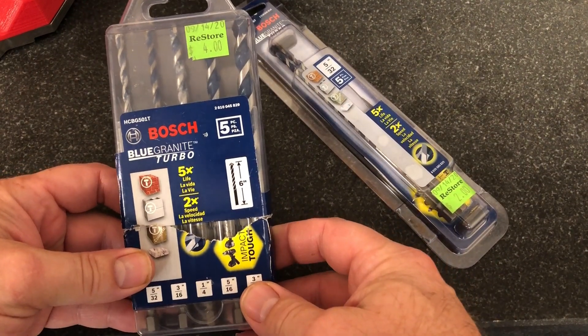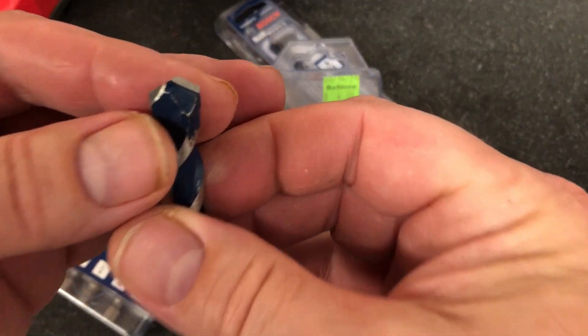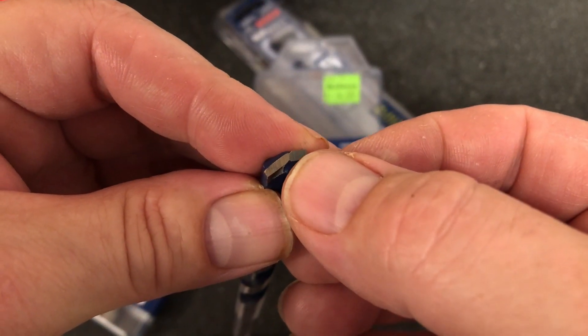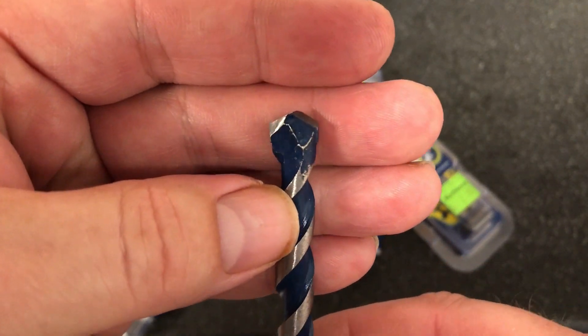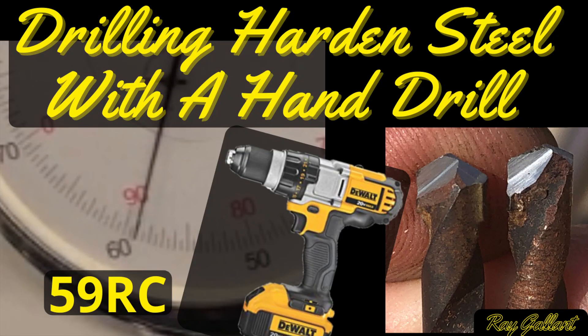I was going through the store the other day and I saw these Bosch turbo granite drills. I took a look at them and thought, wow, that's almost the exact same as what I'm doing here, except you need to thin the web out a small amount to be able to drill into steel. So these will work and they're off the shelf — another option for you. The best way to do this is in a milling machine, then alternatively in a drill press. You absolutely don't want to do it by hand because the carbide is so easy to break off and they have to be sharp or they won't actually cut anything.